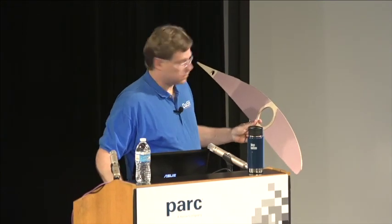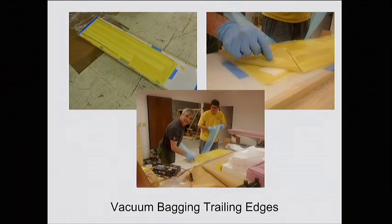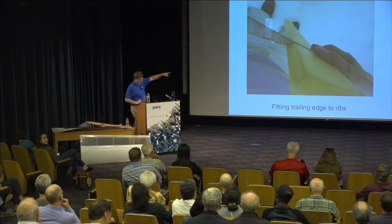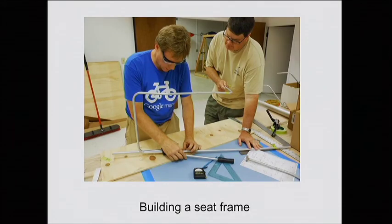Then you laser cut out these doublers — they have little notches and marks on the ribs so that you can line everything up perfectly. You glue those on, and then use the doublers as the template for cutting out the hole for the spar and rear spar. This shows building some small short test samples of the trailing edge — eventually built in 16-foot lengths — made out of Kevlar with another kind of foam. And there's a leading edge made out of Depron foam, which we came up with a process to heat form, so that you get a consistent rib shape between the ribs. These are laminar flow airfoils and the shape is very important.